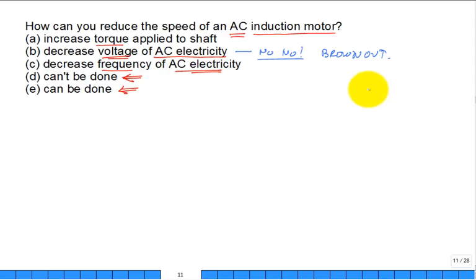Maybe if you stuck your wires and tested the voltage in our plugs here, it's probably about 122 volts AC. I've done it a number of times with a good meter just to check it. It fluctuates some. Typically, people will talk about 120 volts AC. It's never spot on 120. They try and keep it around 120. That's the kind of give and take. There's no storage of electricity. When it's made, it's consumed. And if there's a loss of production in the grid, it creates problems.